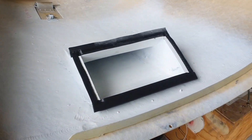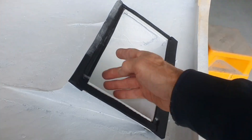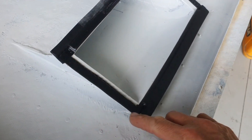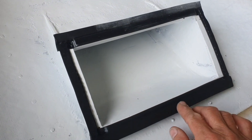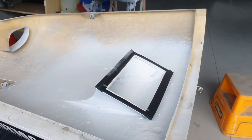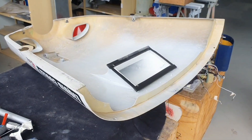You can see what I'm talking about there — that's the shape of the duct as it comes off the top of the scoop and flares out here. It also curves in here, and I've got a seal all the way around the outside so it seals perfectly against the radiator. You can see it's already made an impression around the outside — absolutely zero air leaks. It curves beautifully into it. With that higher efficiency you can afford to run a smaller radiator, which is exactly what we've done.